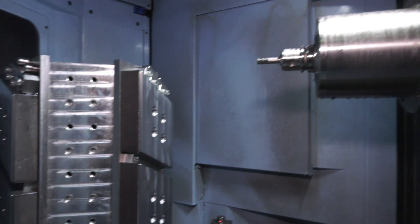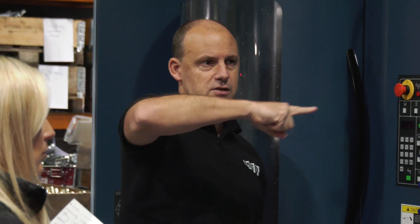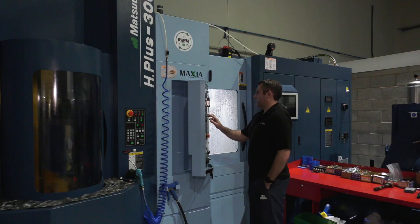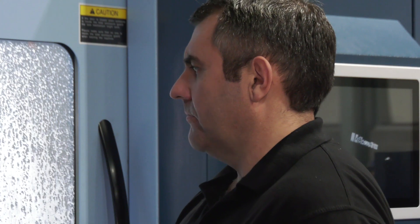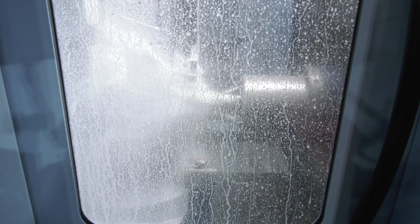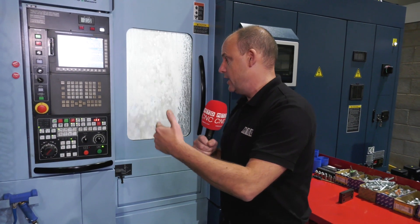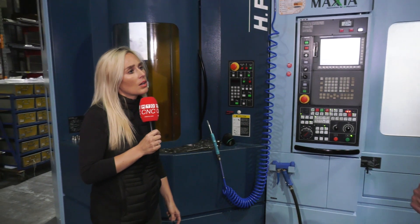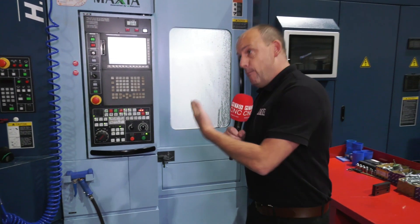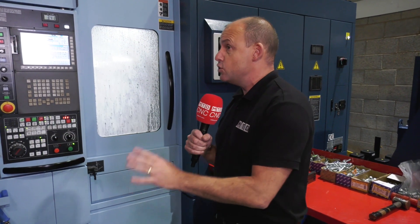So why go for the horizontal? Talking to Sean and Ryan here, they did a lot of research into what machine and what style of machine was going to be best for them. The horizontal environment is brilliant for the parts they're machining — they get great swarf fall away. Originally, these components were being done on verticals but they were getting swarf issues, T-slots getting clogged up, not being able to get the swarf out. You can hear how much material is being removed — you need a machine where you can get rid of swarf quickly.